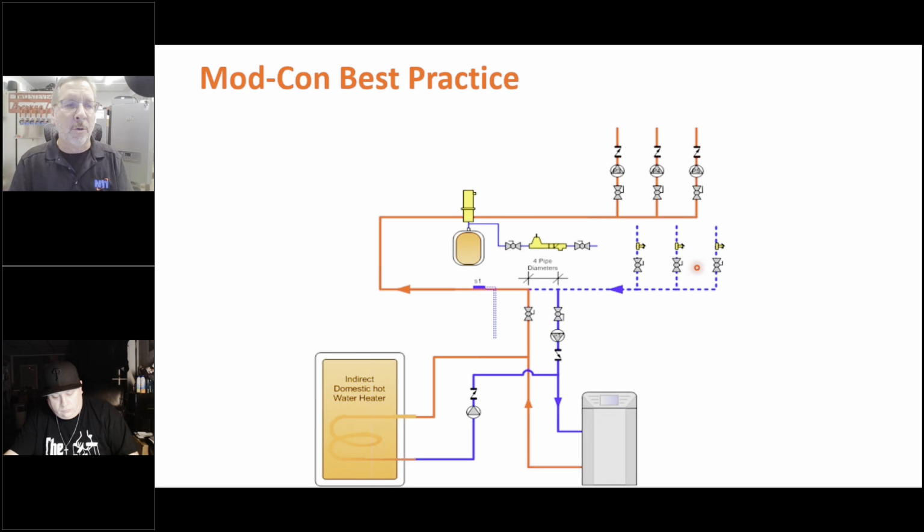And what happens is when this is doing heat, it's just running fine. This pump's just running around, having a great time, giving you outdoor reset. You get a domestic hot water call. It turns this P1 pump off, tells the boiler to go to 180 degrees while it's turning on the domestic hot water pump. Now the domestic hot water gets flow going through the boiler. When that's satisfied, this pump goes off. This pump comes back on. The boiler says, oh, back to outdoor reset, and drops its temperature as it's flowing. These zones never shut off. It kept on going and everybody's fine. So far, so good.